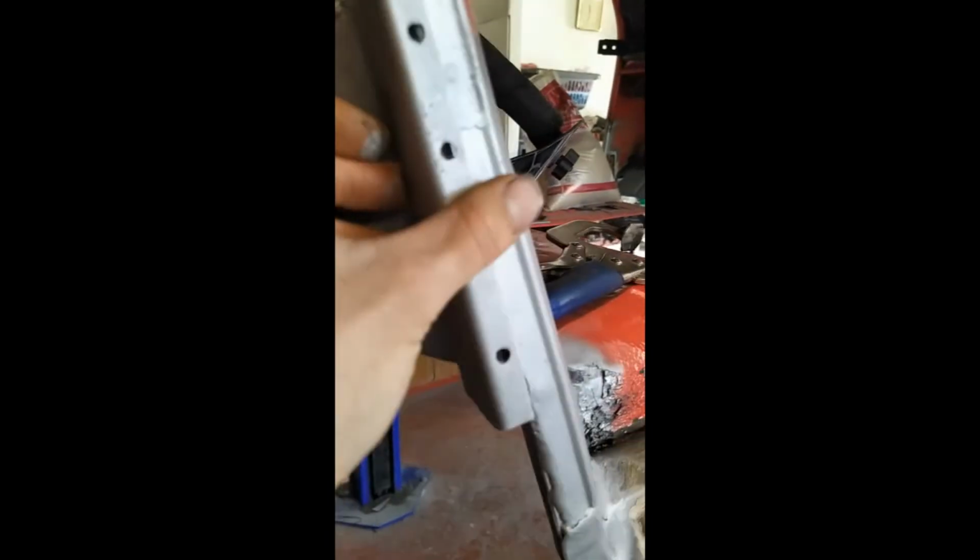Here again. So I've cut that bit off. As you can see, it's because it just wanted to fill that tiny hole in. So next, don't fall over. I made this new piece. It's just a piece of angle, or it's a flat that I made into angle, shaped it, cramped that end off, drilled holes in it so I can plug it up, lined it up with the seam that already went down there, so that's going to weld into there.